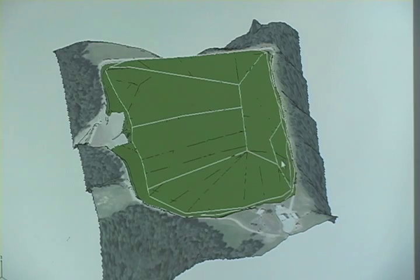The way we have designed this is kind of a chicken coop design with some valleys in it. This is the main ridge right here — that's the high point. Then we have this ridge and this valley here on the project, and this ridge. Most of the water that comes off of the site will continue to go down through the east drainage, with a minor amount coming off here going down the south drainage, and some going down the west drainage.